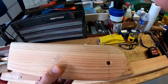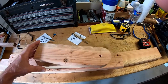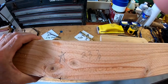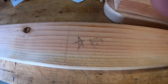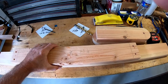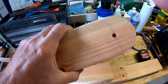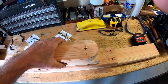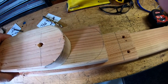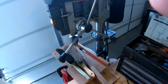There are only three different components to the whole cornhole board: legs, tops and bottoms (boards that are 23 and seven-eighths inches), and sides which are 45 and one-eighth inches. You're going to make eight of everything — eight of everything gives you four complete cornhole boards. Once you've got one leg completely made just the way you want it, drop it onto a raw 12 inch board, trace it out, cut it, and use your drill to drop through the hole for alignment.